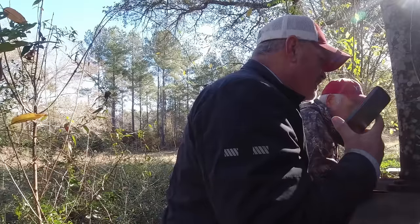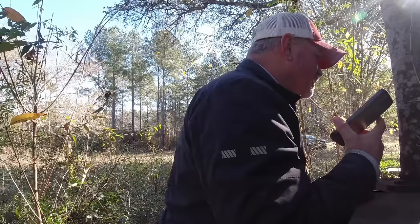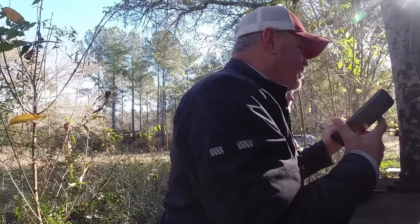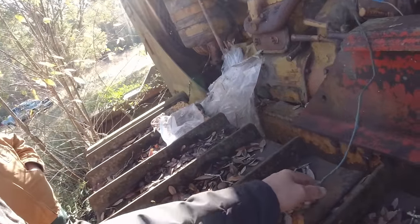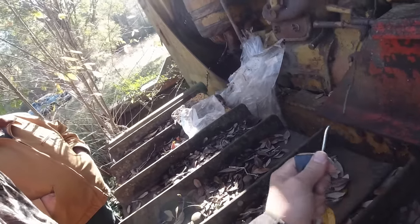I wasn't thinking about that last night when I was telling you about that little wire that goes to that pony motor. You might want to unhook that, because if you throw 24 to it, it'll burn that little pony motor up. I think someone's already thinking about it. Yeah, I think someone's already done that for us. Oh my goodness. Yeah, there's one that says starter ground right there.